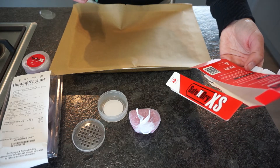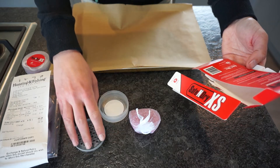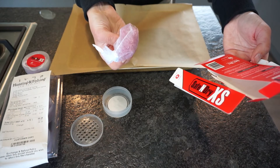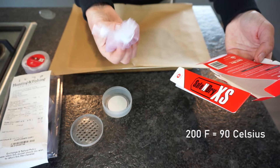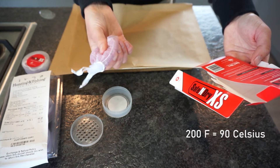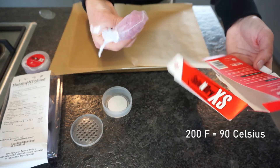The recharging instructions say: remove the perforated lid by pulling the tab, then remove the indicating silica gel from the plastic dish. Place indicating silica gel in a vented 200 degree Fahrenheit oven for a total of three hours. When fully recharged, it will turn back to blue. Wait for the silica gel to cool off prior to refilling the plastic dish.